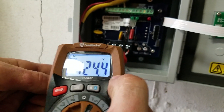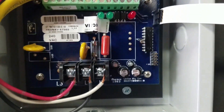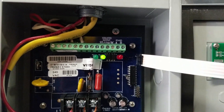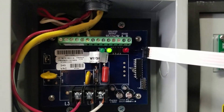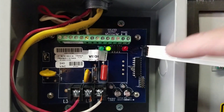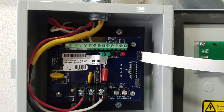If the connections are out of phase, the red reverse phase indicator LED will illuminate. There must be a load drawing a minimum of 1 amp connected to the meter for the reverse phase LED to function correctly. If this LED is on with sufficient load, power down the voltage supply and verify that the current transformers are installed correctly.